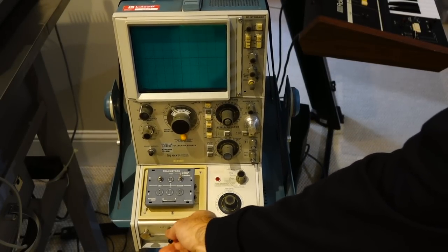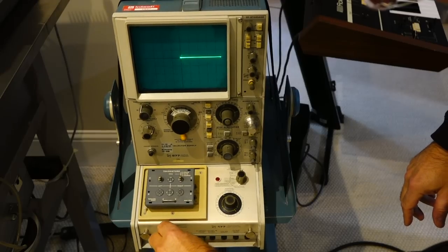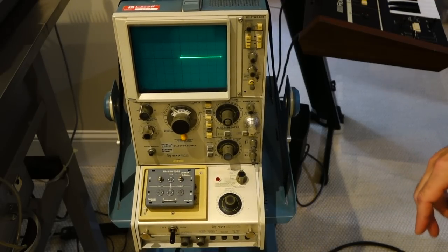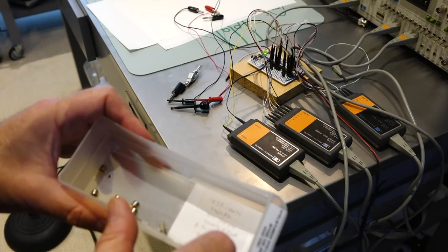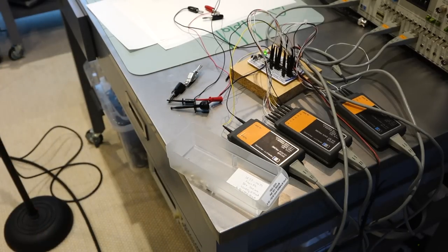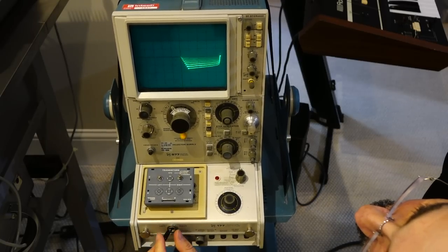It works. Ooh. It works, but barely. One has double or more the gain of the other one. So fortunately, those are transistors that I have. A 30-volt, 400 megahertz, low VCE(sat). It took a switching transistor that could withstand the higher voltage. Let's see if we can match one better. Okay, that's a better match.